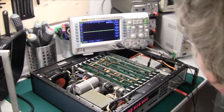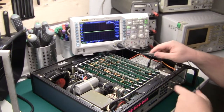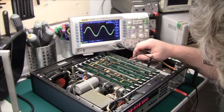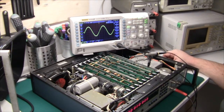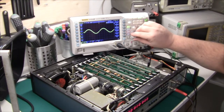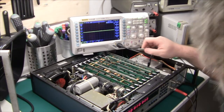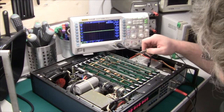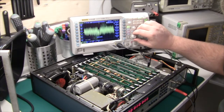I'm back and I've finished soldering, and now I can probe the input. The signal from the front goes to this pin here, and there is a gorgeous sine wave — it's a little bit noisy but my oscilloscope probe is not too good. So we have the input signal from my signal generator actually reaching the board. This is the signal after the isolation amplifier, and we see 34 kHz here as well. And we have another signal here which is the other input to the mixer — which is a terrible signal.